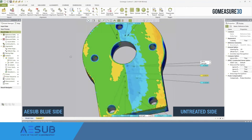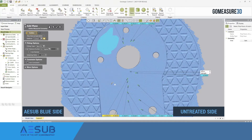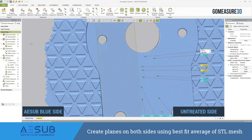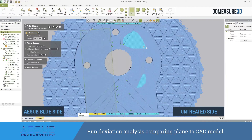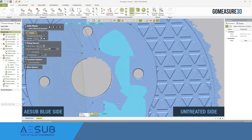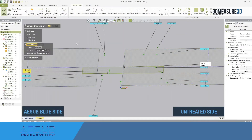Let's take a deeper dive and run a couple more tests to further understand this product. The first thing we're going to do is create a couple of planes on both sides using a best-fit average of the STL mesh on either side of the part. From there we'll run a deviation of those planes to the original CAD plane. This value is a deviation of one plane to the other of only 4 microns, which is considerably less than the 18 microns we were seeing when we just used comparison points.